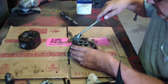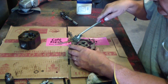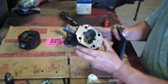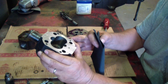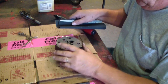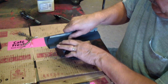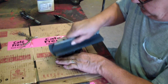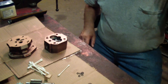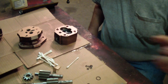The razor blade doesn't seem to be scratching the metal at all. You can see I got one piece done — didn't take me that long — and it's pretty clean, so that seems to work good. Once I get it scraped off fairly well, I use a piece of angle iron as a straight edge. I cleaned all the pieces up, got the O-ring to fit, and sprayed it with that copper spray.